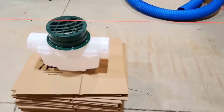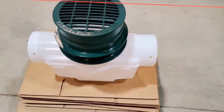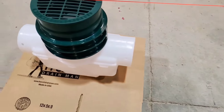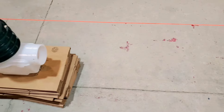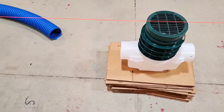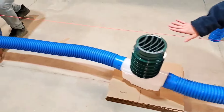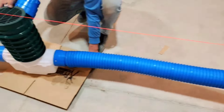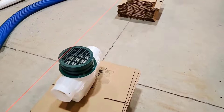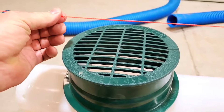Go to the second basin and add a riser. Third basin has two risers, and so forth — you just keep adding a riser. This is the simplest way to get slope on a yard drain. We have nine catch basins over the length of 50 feet, and all the grates are set the same.